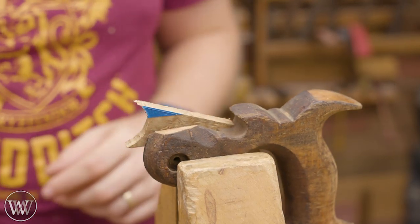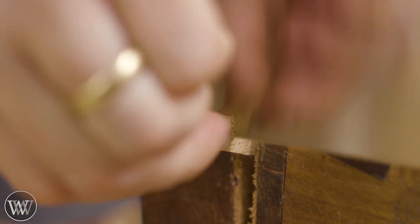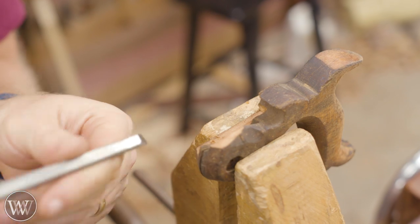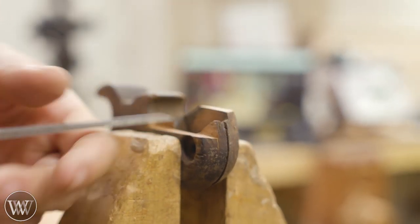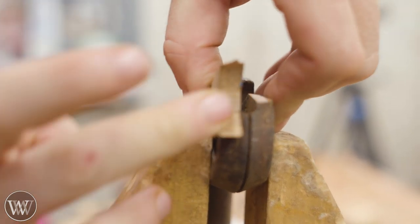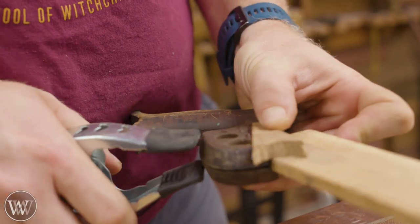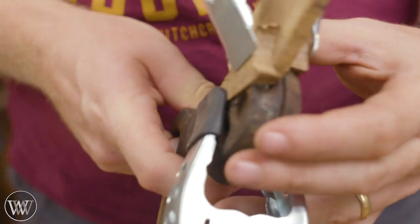This actually worked out pretty well — it was about the right thickness. So I cut off little chunks of it and made them fit in there, making sure there's enough space that I can then rasp and file around them. I want to make sure there's more sticking out than I need because it's better to have more than not enough. Just a couple little pieces that need to get glued in place. To clamp these and glue them was a bit of a challenge. I went back through and made sure everything was a nice tight fit — they don't need a lot of pressure, just to be held in place. I want it all to be perfect and just sit there. For the glue I'm using a five-minute epoxy because I wanted to get the whole thing done in the time I had. If I weren't doing that, I'd probably use a West System epoxy. I put a spacer between the two jaws that was the exact same thickness as the brass back, so I could clamp things to that spacer and hold them in place.